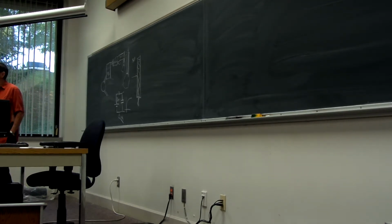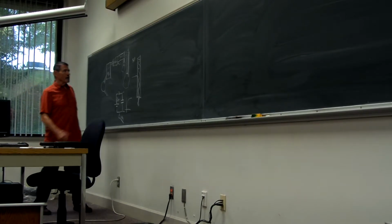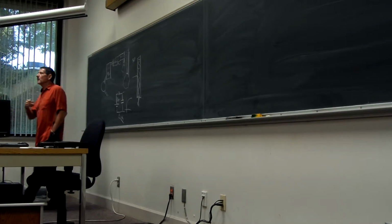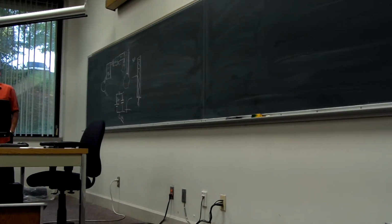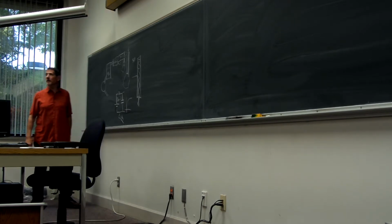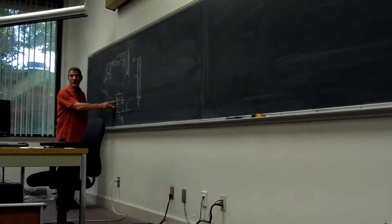So the bigger the resistor, what happens? Longer the time constant. Bigger the capacitor? Longer the time constant. Is that all right? So if I'm dealing with a balloon here and I got a small soda straw, how long is it going to take the balloon to blow up so that it stops moving? In other words, just like a capacitor, you're going to dump charge onto it until you get it charged up, and then no more flow is going to happen, and it will maintain the 3 psi across it.